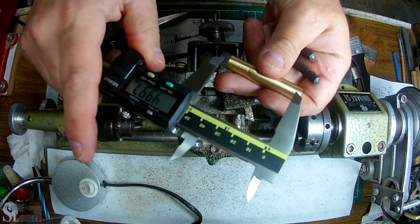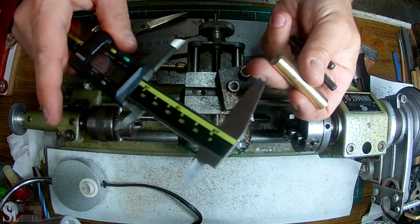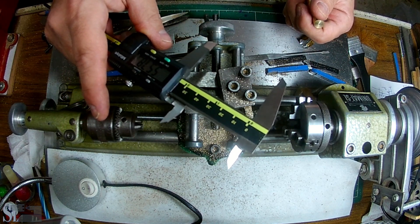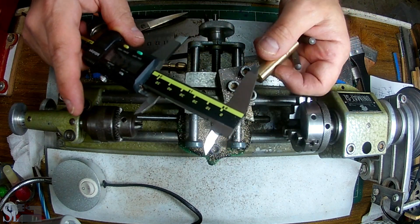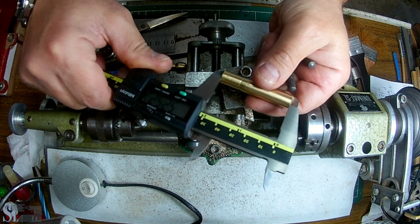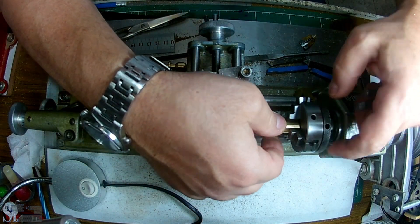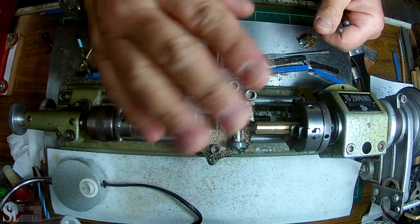We're at 52mm. We're definitely in a problem with this one — the drawing calls for 52mm total length and we're at 52.5mm. Let me measure that properly: 52.5mm. I still have to face this one. I've got a serious problem — if I try to center it, this whole thing is going to go bye-bye.